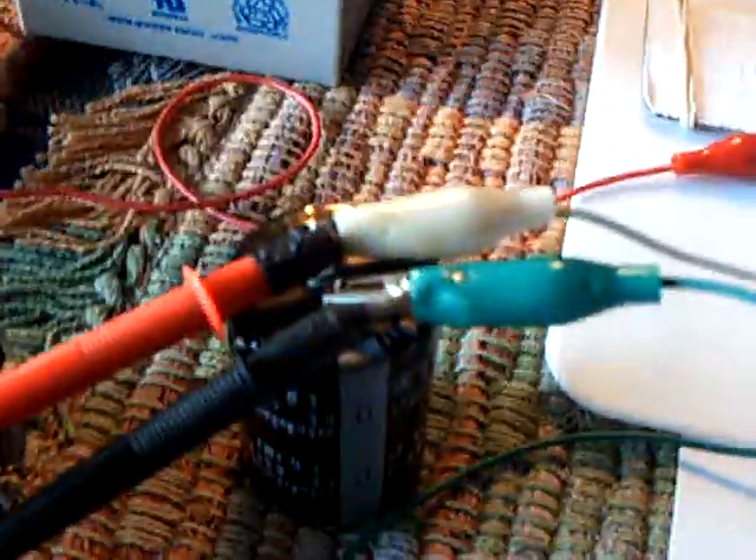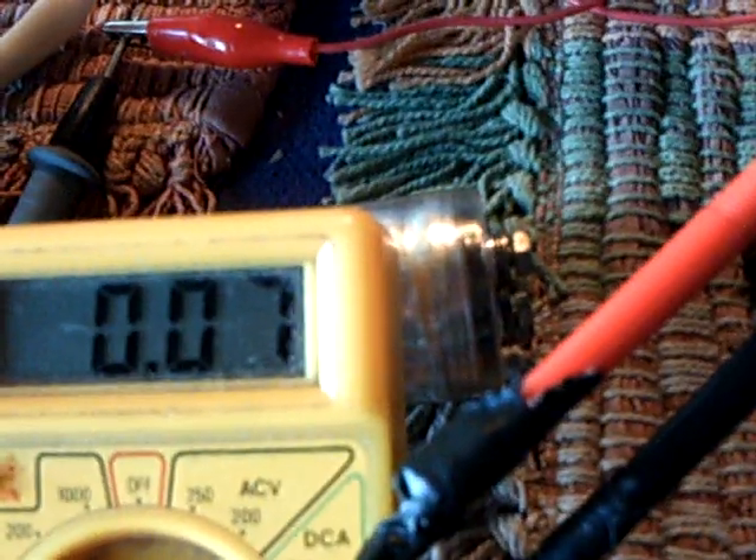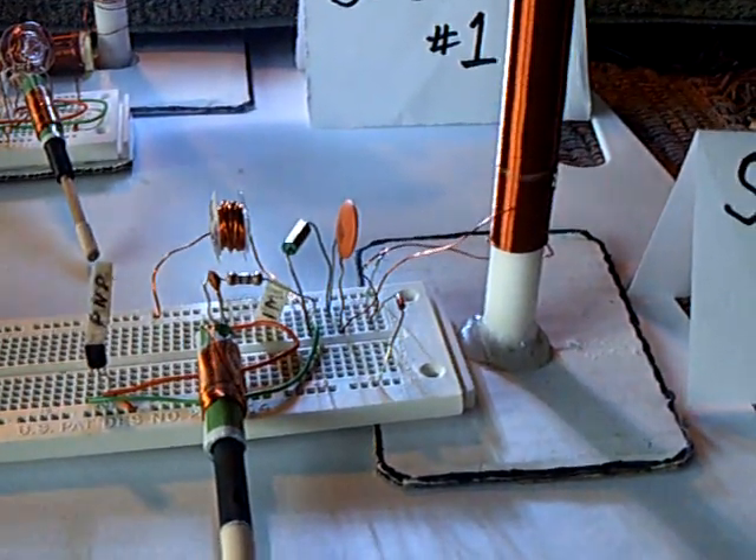I've got the SEC running here at about 22 milliamps on a 12-volt battery, and it's not on full bright, but I just wanted to show the charging aspect of this. I've got a fairly large capacitor there, and it's grounded out right now. I'm going to unground it — the SEC's going to continue to run and that cap's going to charge. Okay, here goes the cap. This is what he showed in his video: you can have a SEC running and transmit over to another SEC, and while this SEC is running, the circuit charges a capacitor while it's running.